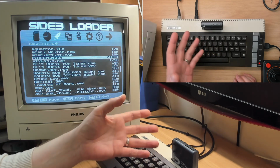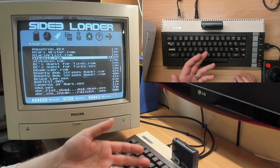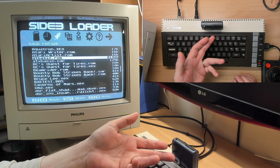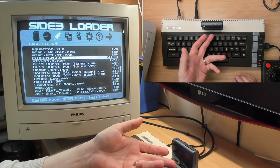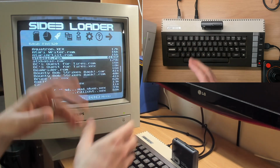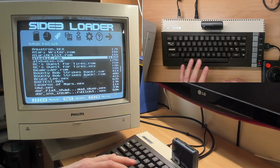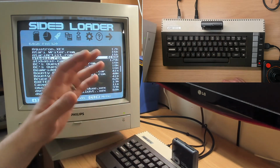Prior versions of the hardware, you had to have the cable, the Xilinx platform cable as it was then. There was no way to do an in-place software update. I'm not talking about the ROMs here, the loader and that kind of thing. I'm talking about the actual code that describes how the hardware works. This one you can do it, but I wrote the tool.